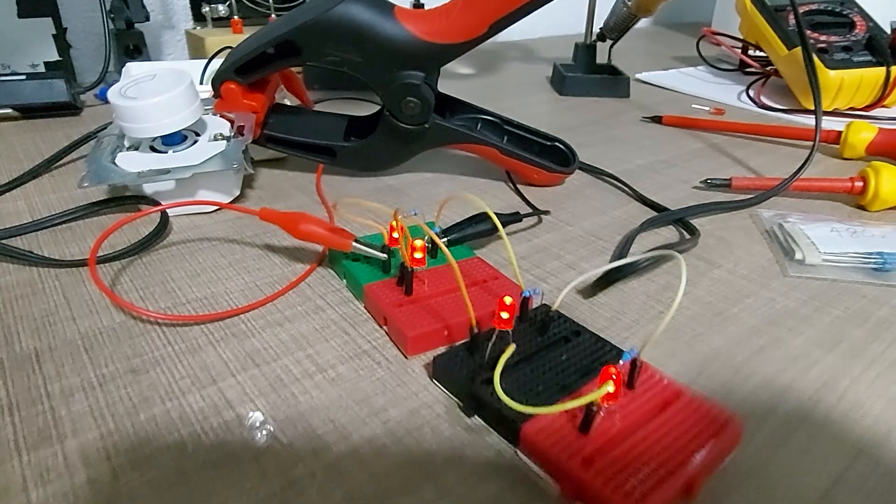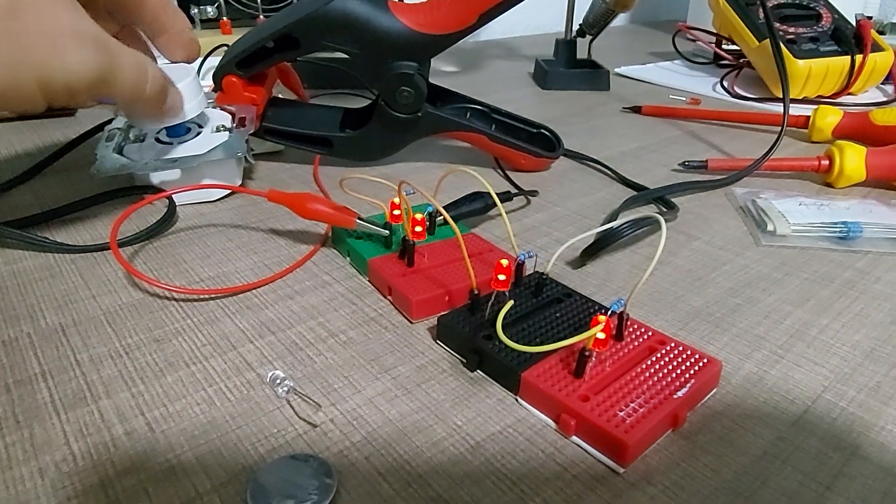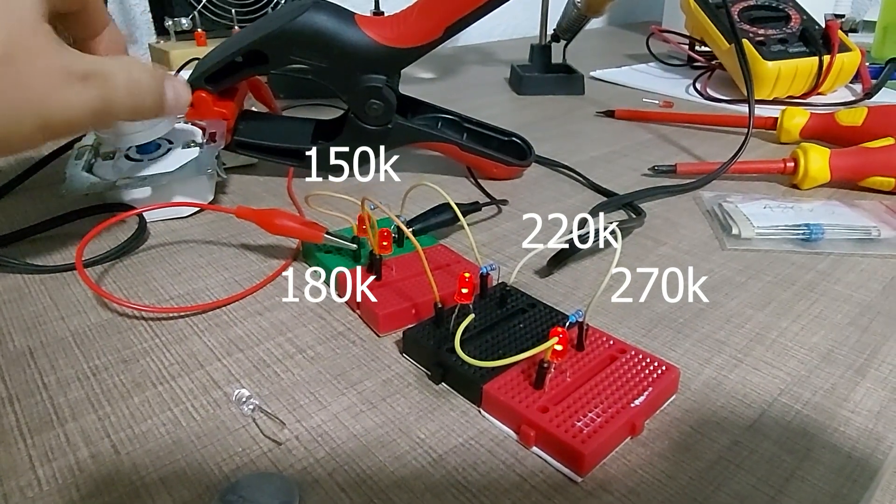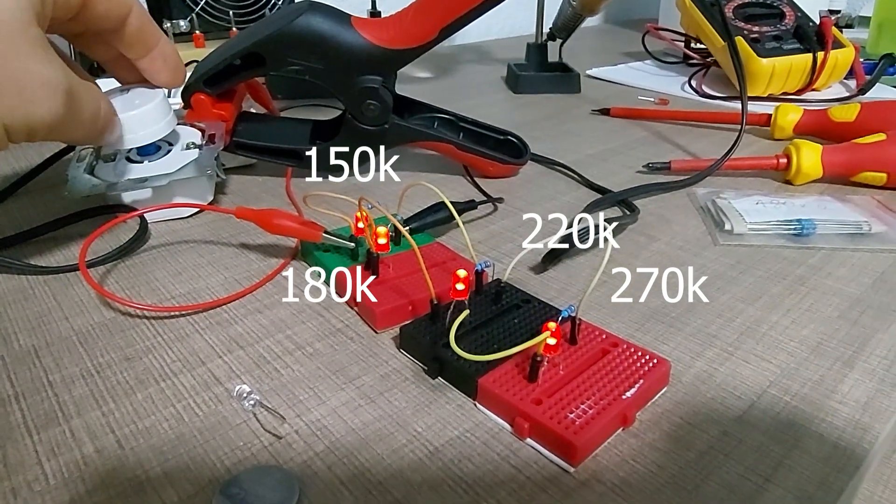For my tests, I made four circuits on breadboard that consist of a single red LED and one resistor, where I used 270k, 220k, 180k, and 150k ohms resistors respectively. More or less, all of the LEDs look okay and are fairly visible even with the lights on. There is a slight but visibly noticeable difference in light intensity as expected, where the LED with 270k ohms is the dimmest and the one with 150k ohms is the brightest. The difference is most noticeable when the dimmer is set on its lowest setting and not so much on the highest.